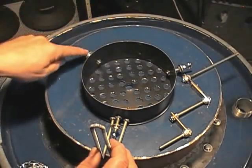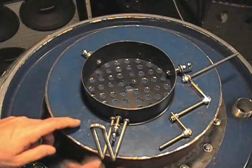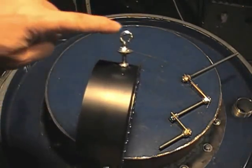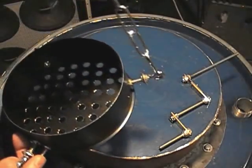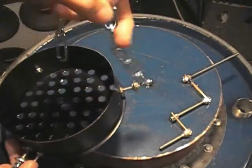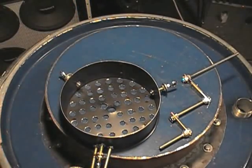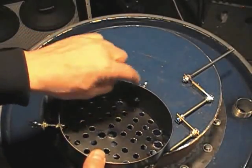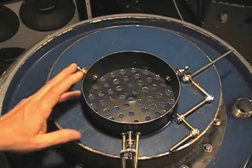Notice there are three hooks, each set 120 degrees offset from the others. Inside the unit I've got chains hanging, and this grate hangs on them. I used 59-cent hooks and spread them open just big enough for the chain to go in so it can hang but can't come off. It can't slide forward either because I've got a washer held in place with a couple of nuts. I did that on all three. The holes are about a half inch up from the bottom — it's not critical; build it to your own specifications.